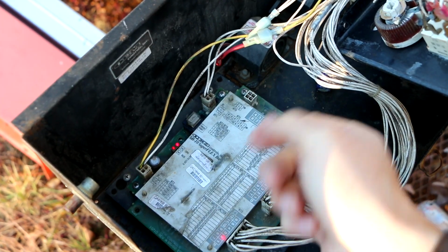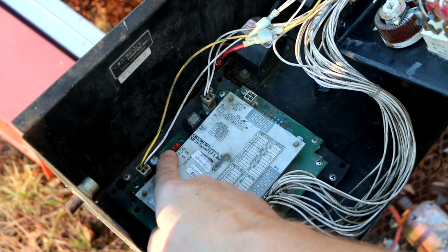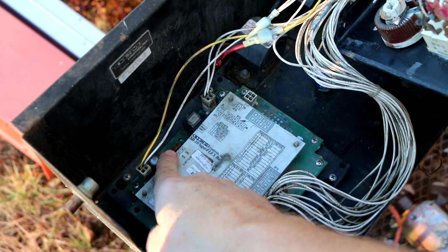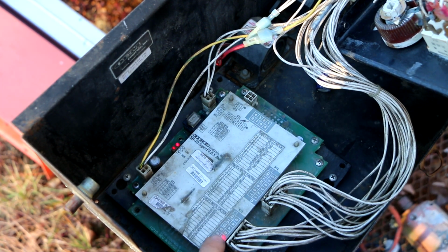My thinking was that this bus light shouldn't blink unless there's actually activity on the bus data line. And I wouldn't think there'd be activity until you were actually wanting to do something. So then I thought, well, maybe this LED number 2 being on all the time, maybe that's like some logic state that's stuck high or something, right? And maybe that's my problem.